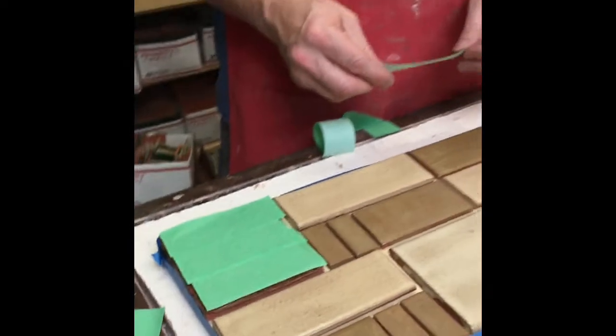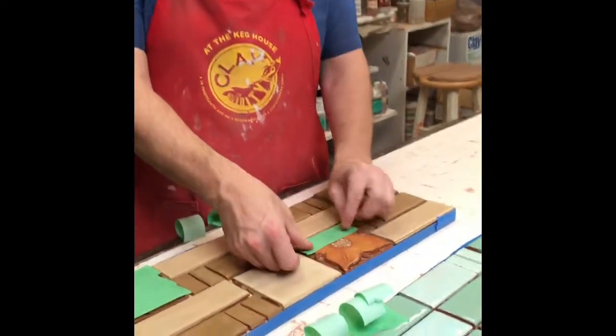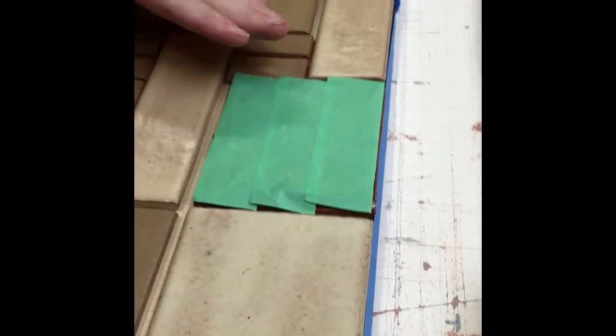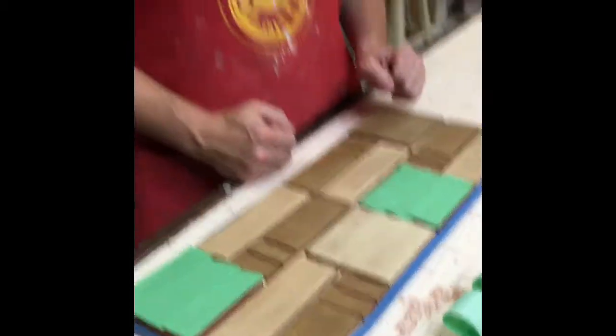As you can see, we put painter's tape on top of the bas-relief tiles to cover them up so the grout doesn't get in there. I cut little strips and add them to the top of the tile. These are really dimensional, and if grout gets into those little areas it gets really hard to clean out. So we tape over the top and then grout over everything and peel off the tape afterward.